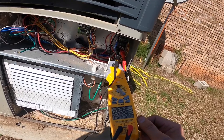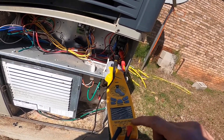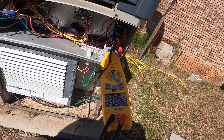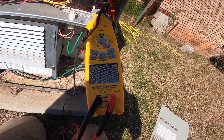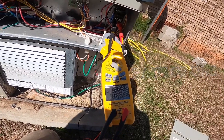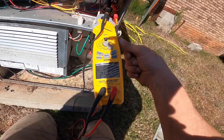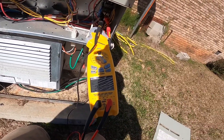Now we can measure a power factor, which gives us the ability to measure not just volt amps reactive but the apparent power. This piece of equipment has an ECM motor, and you see the power factor is close — it's over 0.5. The best you can get is 1.0. A resistive load like heat strips gives you a power factor of one, which means all the power being supplied is being converted into work. This means that some of it is being reacted with back EMF, capacitors, and transformers.